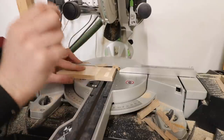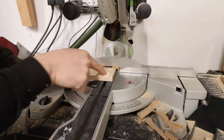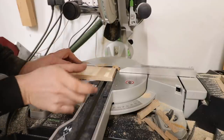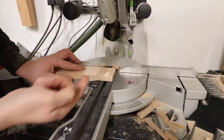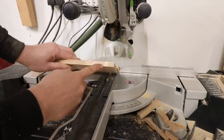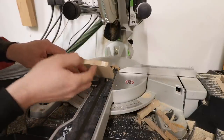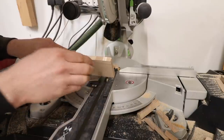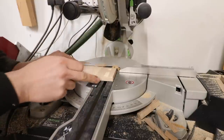so that cuts in a couple of mil with the blade direction running into the wood, so you don't get any breakout there. And then when you get to the front of the piece of wood, have the blade extended beyond, so the back of the teeth are then digging into the wood, and throughout this bottom corner here, the teeth are actually going in at an angle, so it's biting into the wood. So there's no chance of the grain on the outside breaking out because you're cutting inwards. And then once you've got to that point, travel back along the piece.